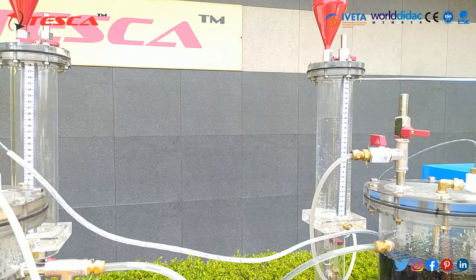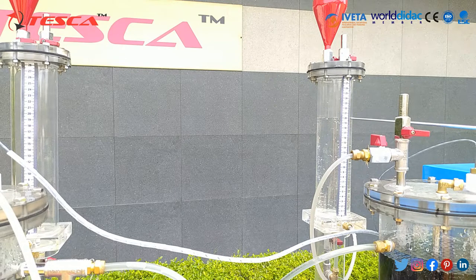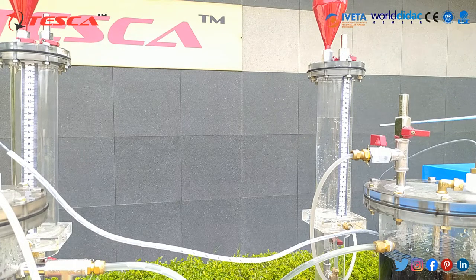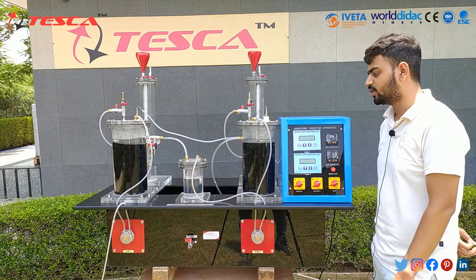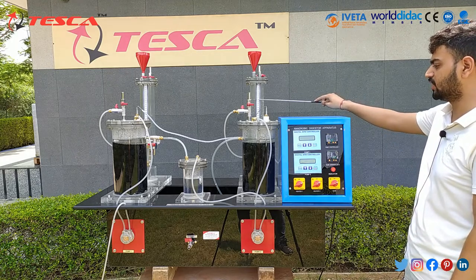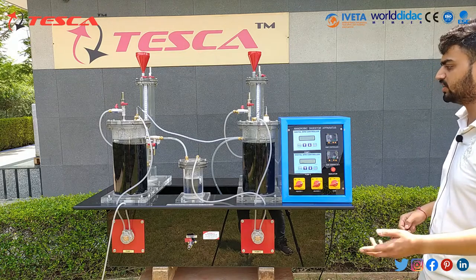This is the scale from where you can fill out your measurement table. The first reading is water level initial — for example, we have filled it to 28, so the first reading is 28. The second reading is water level at the final point; in this case it is 20, because air has filled the gap and drained the water out. The third reading is time taken in seconds — when you start the gas valve you should start a timer to measure the time from initial to final point. You can then find the gas flow rate at different temperature settings by recording the initial value, final value, and time taken in seconds.